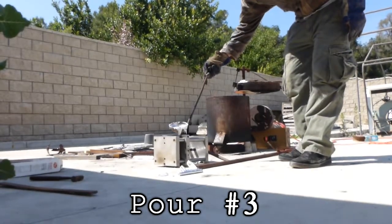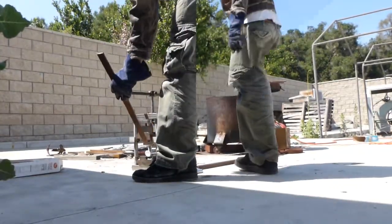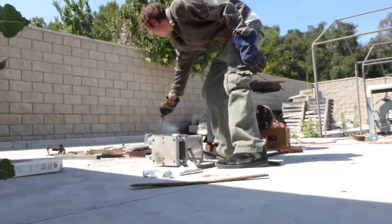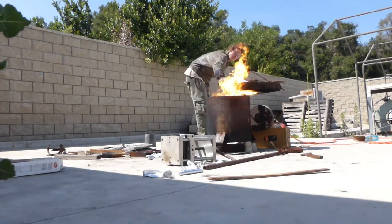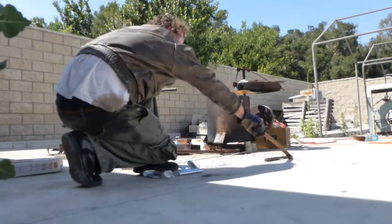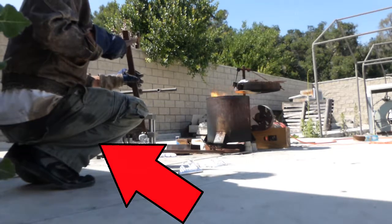Round three. I also got some ingots out of this session with the leftover metal and the ladle. This time it did stick to the ejecting half, but another incomplete soap dish again. I just kept doing it until I ran out of oil or was ready to pass out from exhaustion — it's the foundry workout plan. This session definitely reminded me why foundry season is supposed to be in the winter. And more foundry flares while we're at it. Breaking open our fourth incomplete soap dish casting. None of them were filling today. On one attempt I poured way too much oil in the furnace and the resulting flare pushed me back and I accidentally spilled a bunch of hot oil on my pants — they still stained like that even after going through the washing machine.